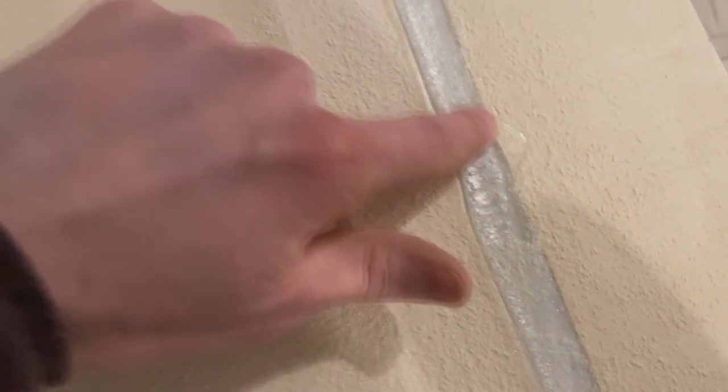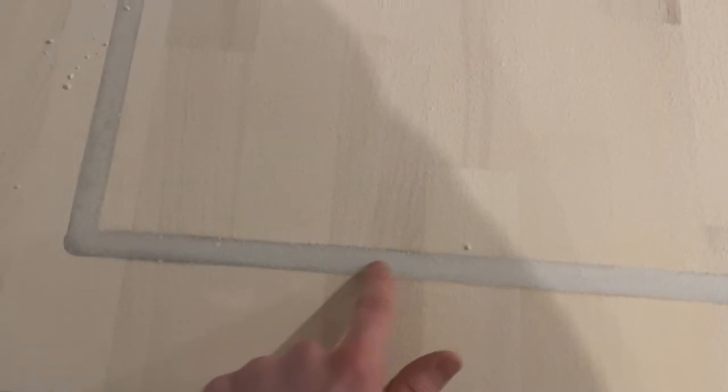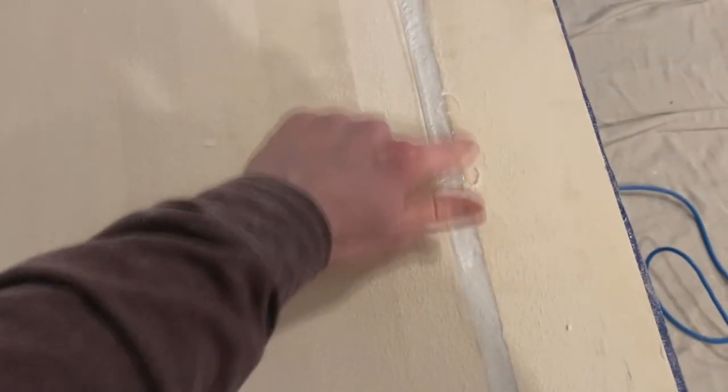You can see where the epoxy's on the wood, like right here, and it overspilled. You get that sheen. That's how you know the epoxy is still on the wood and not eaten off and flush. As you can see along these edges, there's no sheen. It's very flat because it's just wood, and it's soft like wood, not smooth and hard like epoxy. So that's a real good way to know.